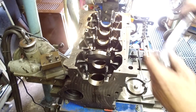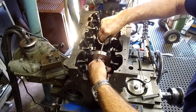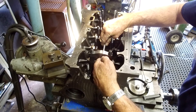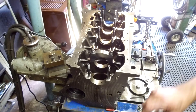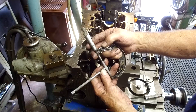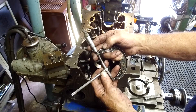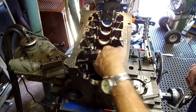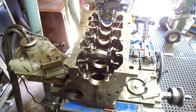Let's see what we've got here and flip this over again. I'm getting two inches 478, maybe a tenth - excellent. And we didn't make a single mark on the lower bore. I can feel a frog hair on each side. That's excellent. This is going to be a good one - if I can do them all just like that, it's going to be an excellent candidate to run the hone through and keep the stock size. Awesome.